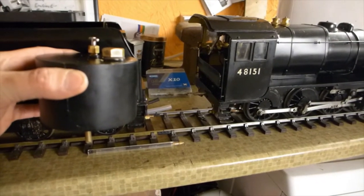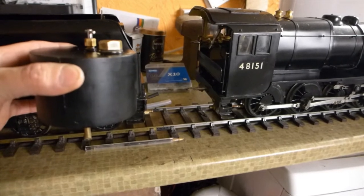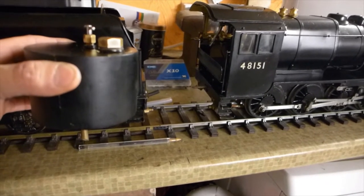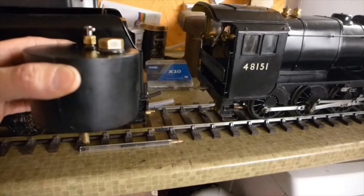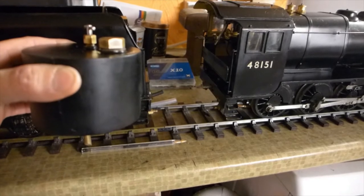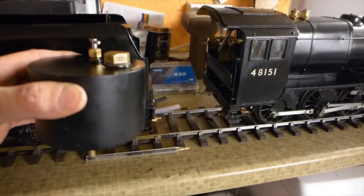The height and volume of the meth tank exceeds the height of the wicks within the locomotive firebox, and also contains more meths than the sump can accommodate. So if you were to open the needle valve and also open the filler valve, meths would flood into the sump and overflow from the top of the sump, and also overflow from the top of the wicks, resulting in a pool of meths on the track, which, if the wicks are already lit, would result in a fire.